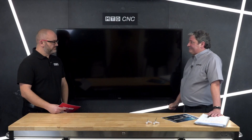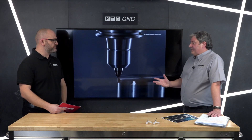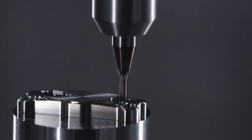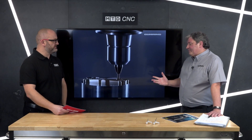That makes it easier to evacuate, and with micro tools it's very important that we can evacuate the swarf as easily and quickly as we can. We have coolant going through the tool — swarf evacuation is paramount with micro tools. Coolant comes through axially, not only for cooling but to get that swarf out of the pocket as quickly as we can.